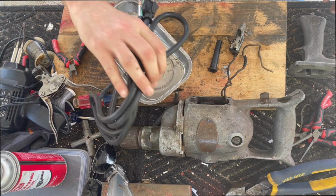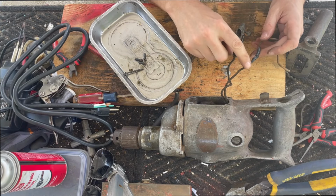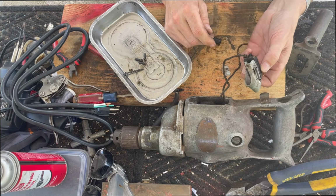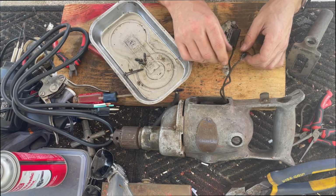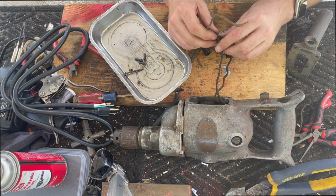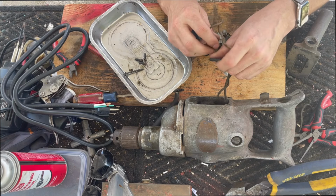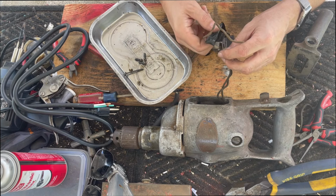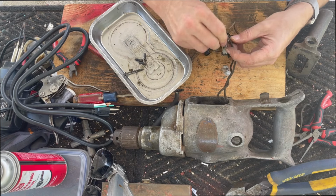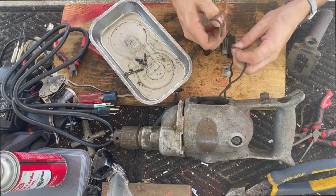Okay, so what I've got is a 14 gauge power cord and a strain relief. So neutral went here, hot went there, right? No, hot went here, correct. All right, look at these motor wires. Motor wires never move, so they're less likely to fray, but we've got to keep an eye on them. Solder this on. They just wrapped it and put some tape on it. Okay.